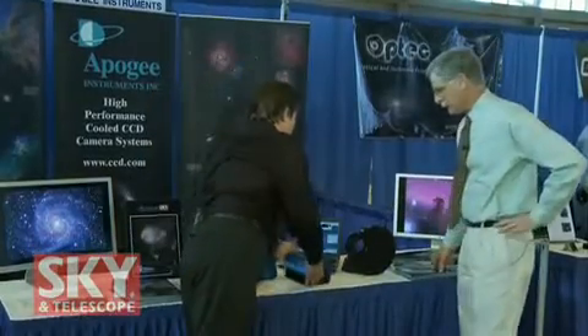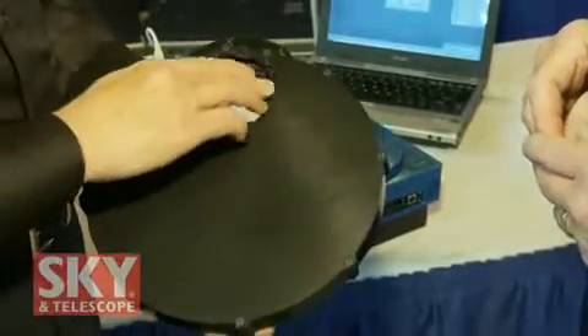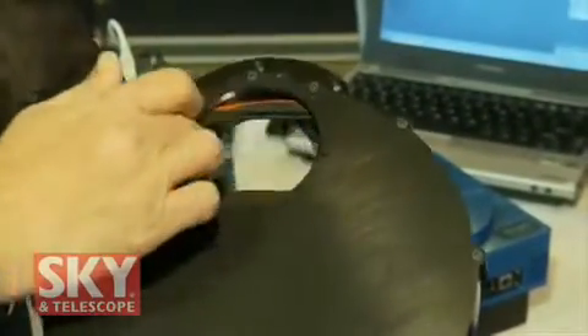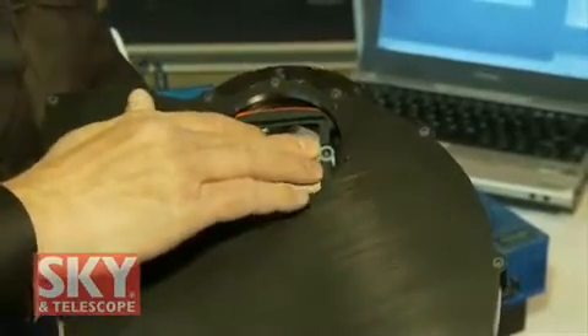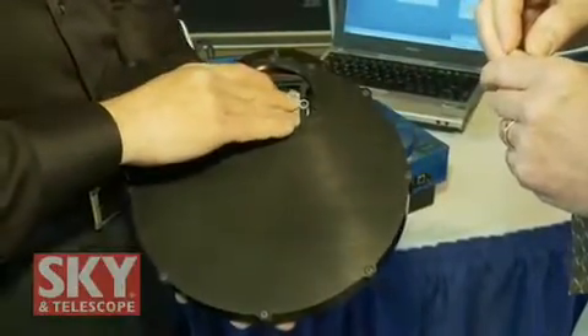Let's move on to the filter wheel to show what's new there. We have some new features — we've had this filter wheel out about a year now. A couple of interesting points: it not only has optical sensing, it also has a mechanical sensor on it. The filter goes one way and has a special ratcheting system so the stepper motor actually pushes it back against the physical detent. For people doing photometry — measurements of stars — or even color imaging, and they need the dust bunnies precisely in the same place, this mechanical positioning provides that. So if you change filters and come back to the same filter, it's in exactly the same position. The nice thing about having the physical hard stop is you don't have to worry about counting steps or encoding errors.